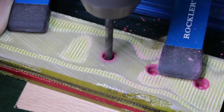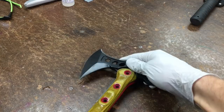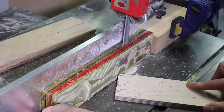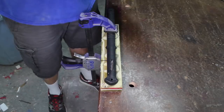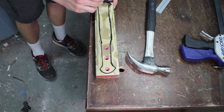Once I had both sides of the blank countersunk and drilled through, it was time to drill out the centerpiece where the tang of the hatchet fits in the middle — basically a slot I had to cut into the blank. I didn't have a really good way to do this and there's a taper at the end, so I just nibbled away and winged it at the bandsaw until it fit. Then it was just a matter of cutting it to shape. I drew my pattern on the blank and cut off all the waste at the bandsaw, then trimmed each side — it was a little thicker than I needed, so I cut off about a quarter inch off each side to get close to the final thickness.